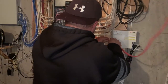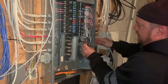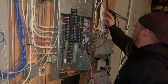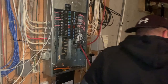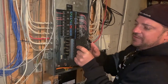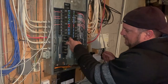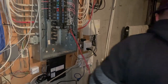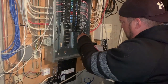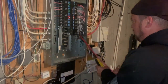We'll bring the wire down and stick it right into the panel. We'll get some straps on that in a minute. We're going to put our breaker in — it's an Eaton/Cutler-Hammer, rated 15 amp. Remember outside on the nameplate it showed max breaker size 15 amp. This is double pole so it goes across two poles, across two bus bars — inside there that gives it the 240 volt. We'll strip our wire. We'd be mindful when stripping to look for other wires around it, but we've done this so many times and it's quite easy for us now.